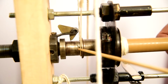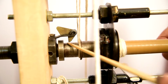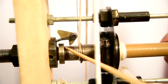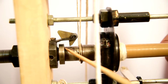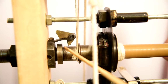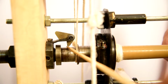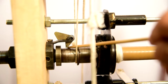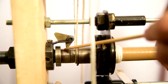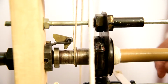While moving at 3200 RPM, if the spindle brake touches the groove and this collar, in 1 hour it will move about 192,000 times, and that is enough to damage this brake. And in one day how much rotation will take place, one can imagine. So we have eliminated this defect, and it gives a long life with this device.